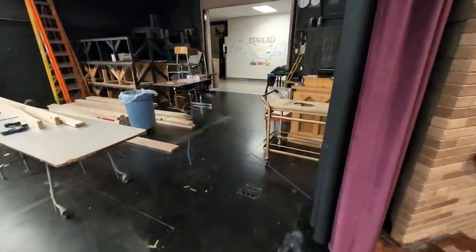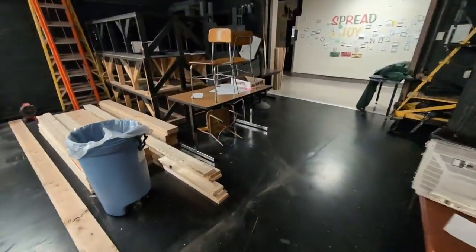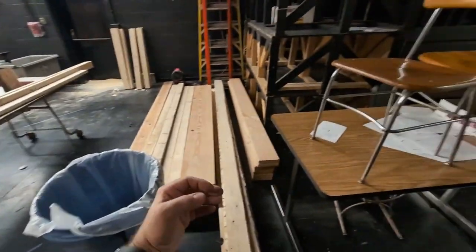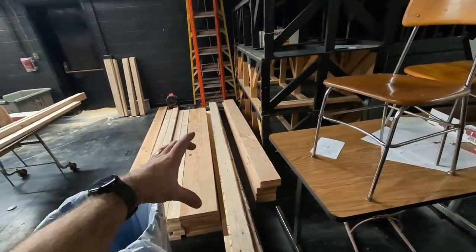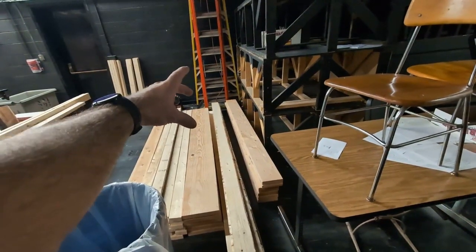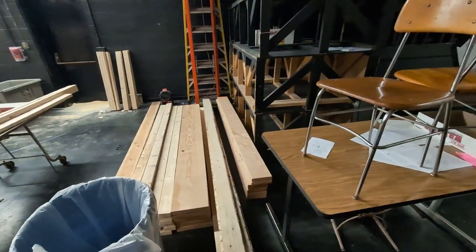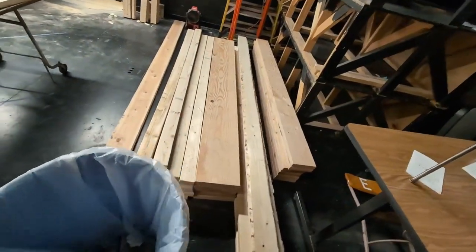You're going to have it at 49 inches to overhang a 48 inch stringer, or, you know, to overhang a 48 inch wide set piece. Then you've got to go to 49. Well, if you buy an 8 footer and you go to 49 on one, you've only got 47 on the other, and it won't work for you. So you waste 47 inches off of each one and thereby double the lumber order just to get the stair treads made out of expensive lumber.